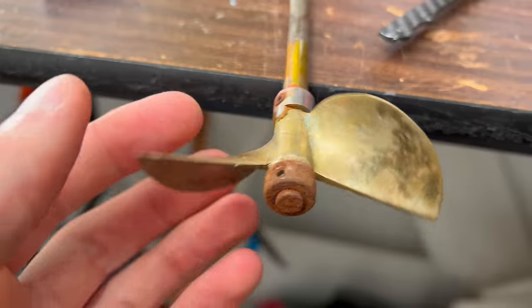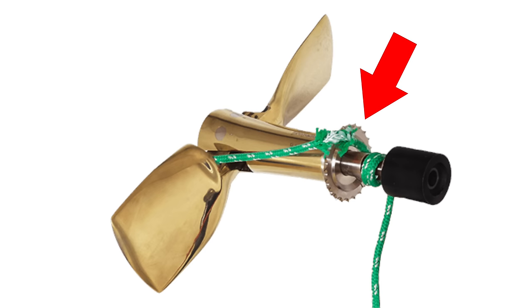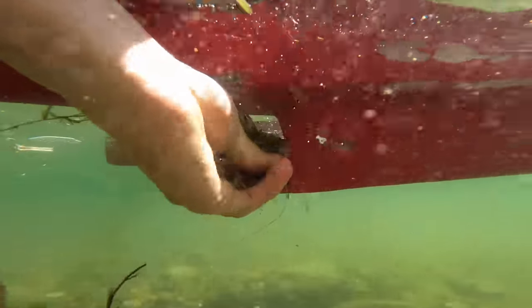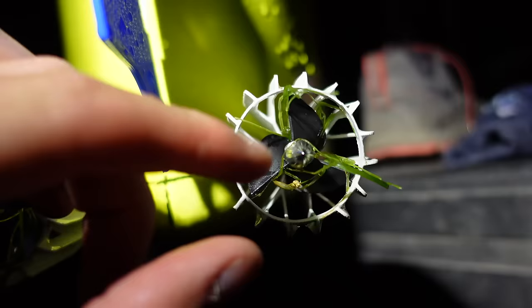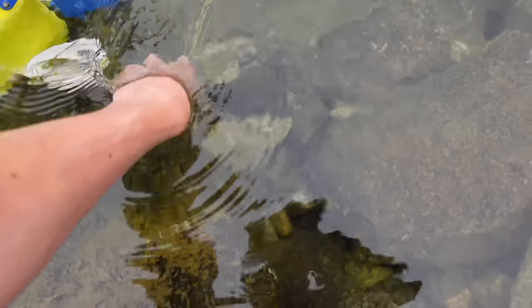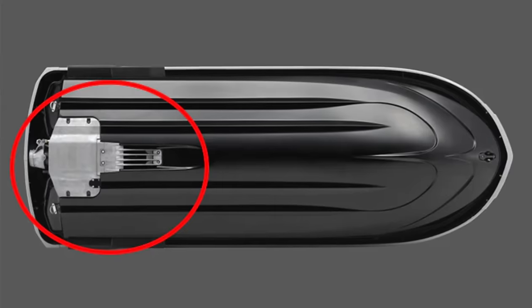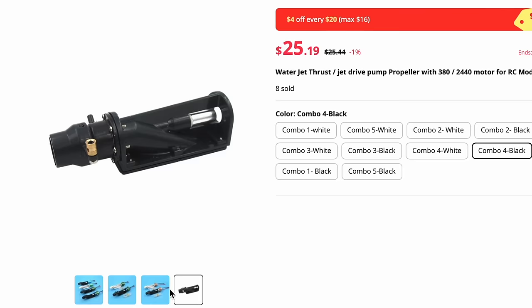Large propellers on real boats are less prone to seagrass, but they do have issues getting tangled in rope. For this, line cutters are used on the prop shafts. I'm not very confident that this would work for my application because the seagrass seems to accumulate on the prop blades themselves, not just the shaft. Next up is wire mesh prop guards. In order for wire mesh to keep out the thinnest of weeds, it would need to be pretty fine, and putting fine mesh around a propeller, or really anywhere under the waterline, is just terrible for efficiency. Water jet propulsion is great for things like jet skis and river boats that need to operate in shallow water, but compared to a normal propeller, it's also very inefficient.